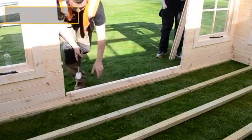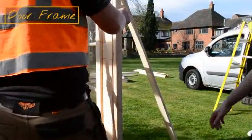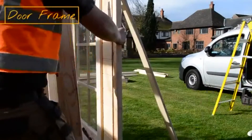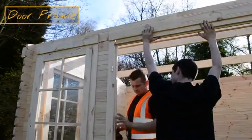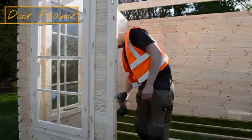Next you'll want to install the door frame. Start by slotting the framing over the foundation log. You then need to remove the rear board from the top and side framing pieces so you can slot them in place covering the side logs. Once the framing is slotted into the doorway, replace the boards on the back of each piece and secure with screws.